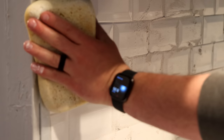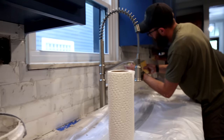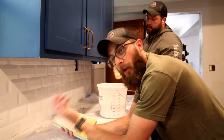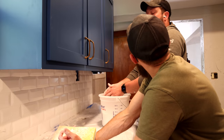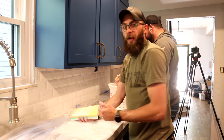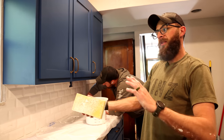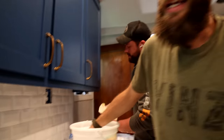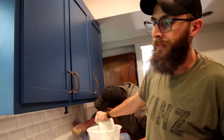So you use the dirty side and then flip it and take the clean part — but you only get like one or two wipes on the clean side. The grout has been floated — or I would say forcefully crammed in the cram hole. Cool thing about doing grout is it feels like this is not the right way to do it, but it totally is. Very quickly it just rubs down to a perfect finish. As it dries, you'll get a haze on the tiles and you'll have to come back with a clean sponge and wipe that off.